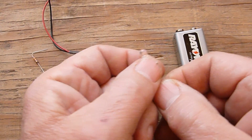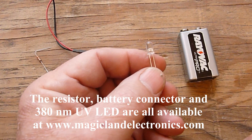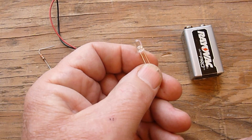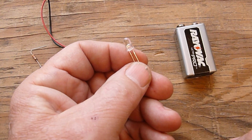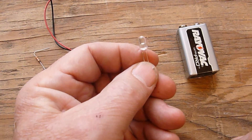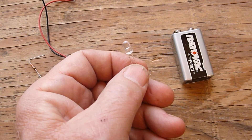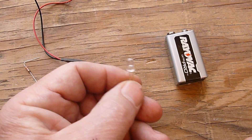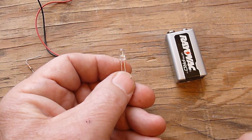This special UV LED is the hardest part to find. It produces 380 nanometer ultraviolet light. While RadioShack sells UV LEDs, they only sell LEDs that generate 395 nanometer UV light. 395 nanometer UV light does a very poor job when it comes to finding out whether a diamond is genuine, although it is okay for detecting counterfeit money. This part is available in an inexpensive kit, which includes a 330 ohm resistor and a 9V battery connector, from MagicLineElectronics.com. A 380 nanometer UV LED also does a superior job when used in a counterfeit money detector.